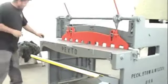Here's a piece of 18 gauge steel. Here's the lock down — holds it in place. You stand up on it, you just pop it down, it springs back up. Pop the metal back out — shears off a nice clean cut. Old metal machine's all been redone.